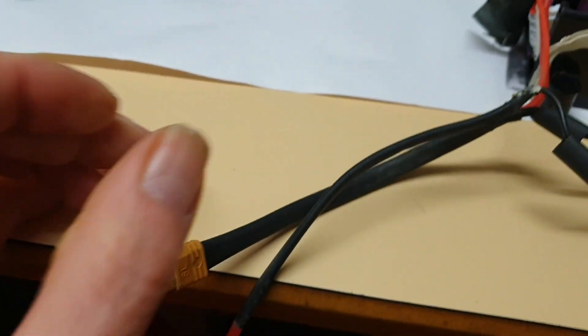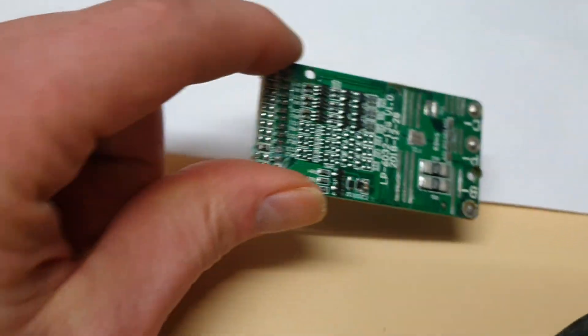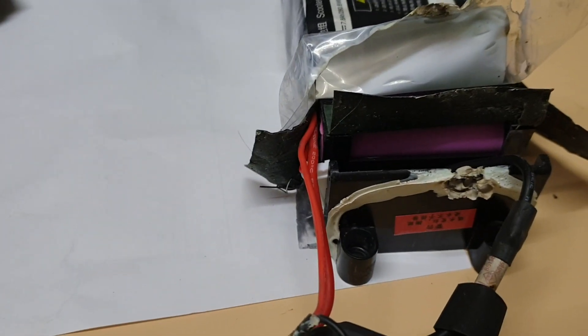You might ask how it works, but as I said, I've built batteries this way and you don't really need a balancer if you have good solid cells — they won't develop different voltages. You should use them in the 20 to 80 percent range and you should be fine for about a thousand cycles with any batteries, unless they fail. Don't charge under 10 degrees and don't keep them at full charge for long. Hope it helps, guys — thanks for watching, and if you can subscribe, that would be great. Thank you, bye!